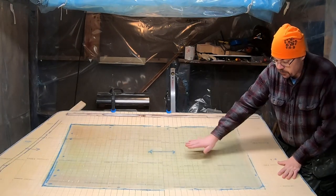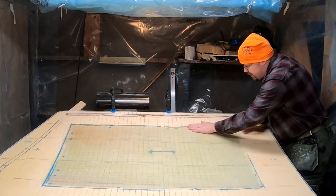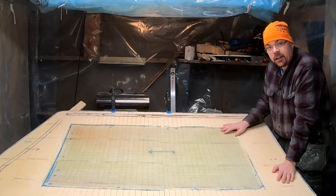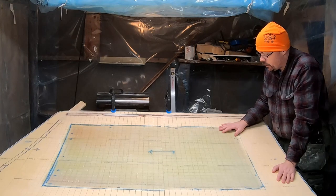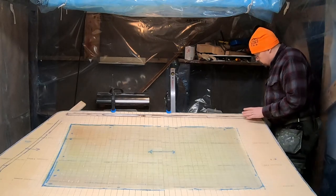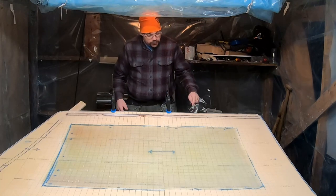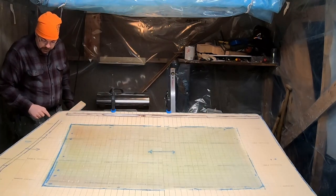I've sanded this surface down. It's pretty flush, almost everywhere except a little bit here, but mostly over here. That I will take care of with some epoxy fairing later on, before I put on the layer of paint on the outside. I also need to fair these edges here. I'm gonna do that with thickened polyester too.